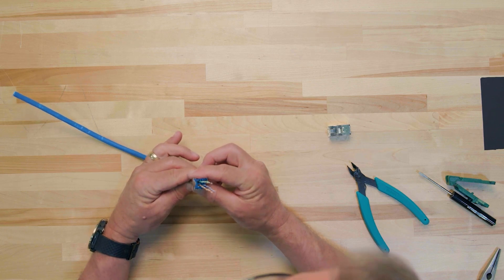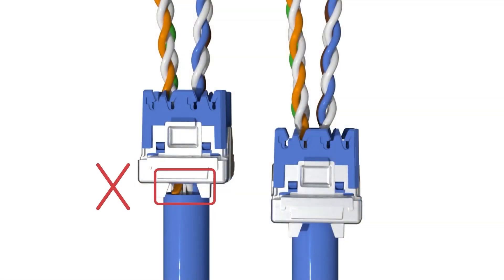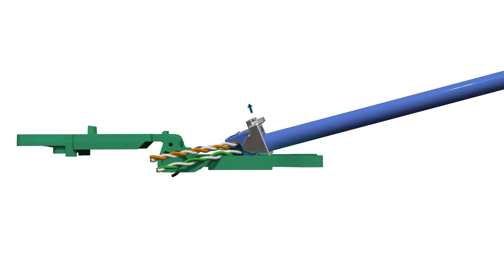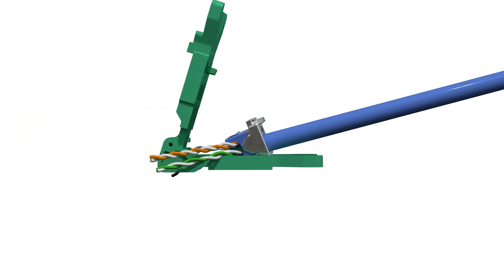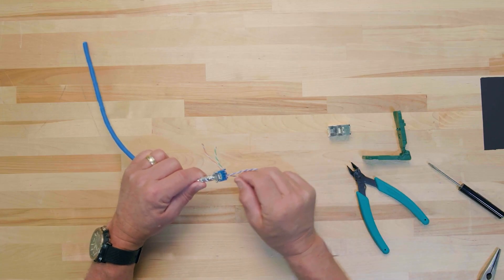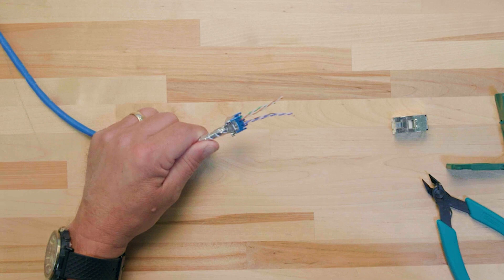Look into the castle and make sure that each conductor pair is placed in the correct quadrant. With your fingers, push the wire cap firmly onto the cable, making sure that the wire cap is fully seated against the end of the cable jacket. Locate the tab on the green EGJT1 tool and ensure it is facing up with the tool fully open. Bend the conductor pairs to the respective sides to hold the wire cap securely into place. Place the wire cap into the matching side slot on the EGJT1 tool with the strain relief facing up. Close the tool and ensure that the tab comes down directly on top of the strain relief. Apply pressure on the tool above the strain relief and fully depress the strain relief firmly onto the cable jacket. Unbend the conductor pairs so they are returned to their original position in line with the cable. Give a firm tug on the wire cap to confirm that it is properly connected and no movement or slack are present.